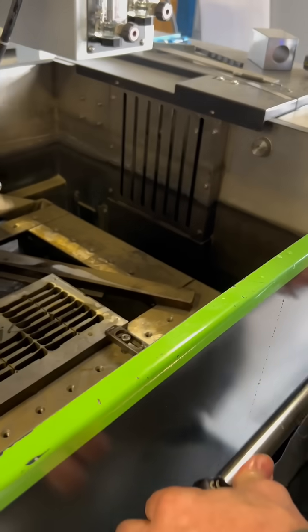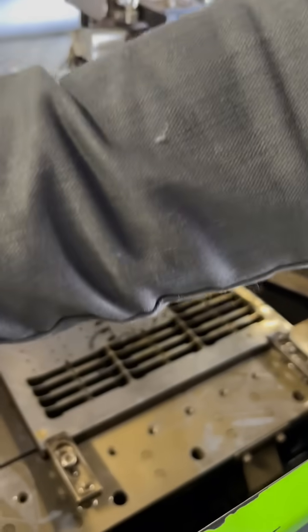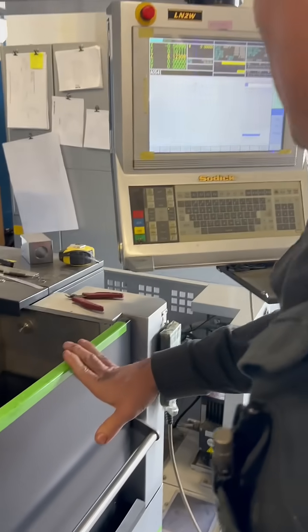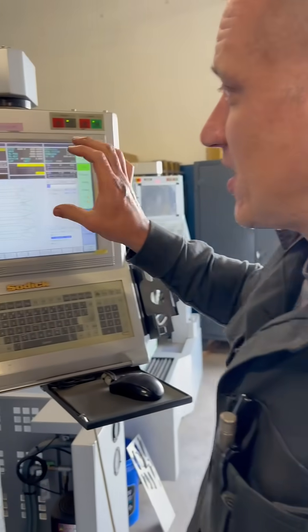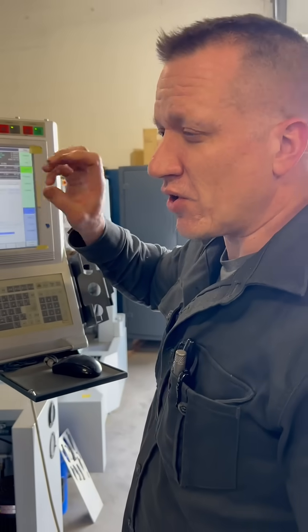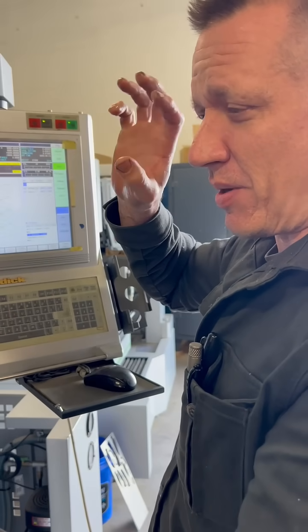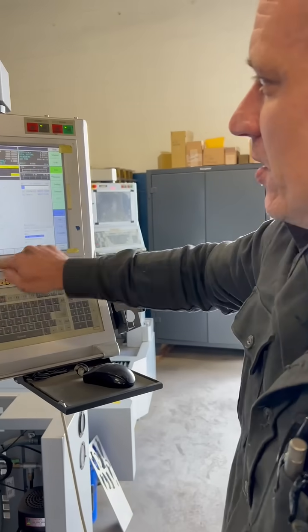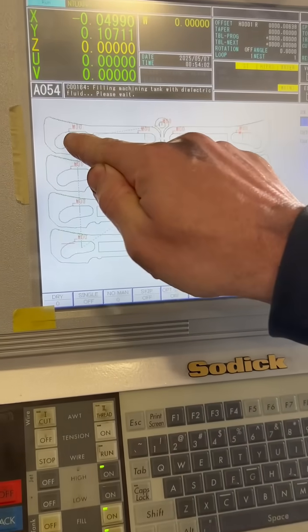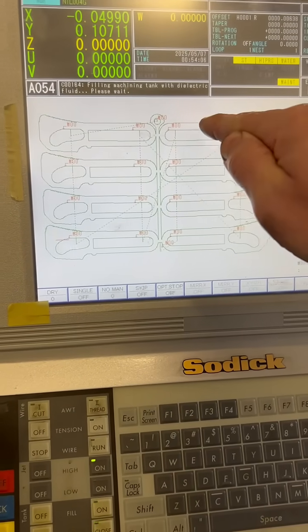There's a lot involved in these machines on a daily basis. It's not just setting it up, letting it run, and then it's done. There are two things here: there's dies and there's punches. Like if you think of a cookie cutter — like a Christmas cookie, the pine tree or the Christmas tree — that would be a punch. The outside is a punch and the inside holes are a die. So we're cutting this out, cutting all these small holes and slots out.